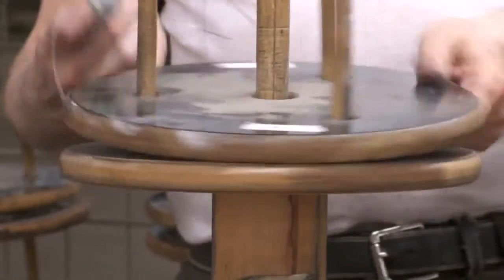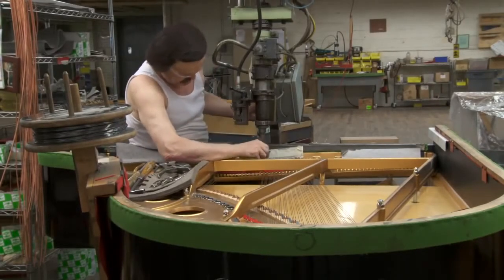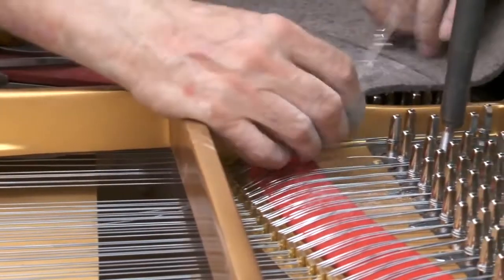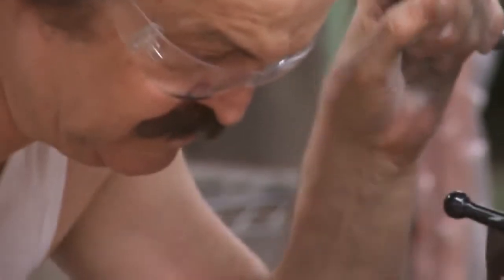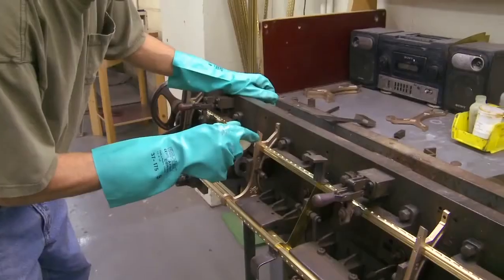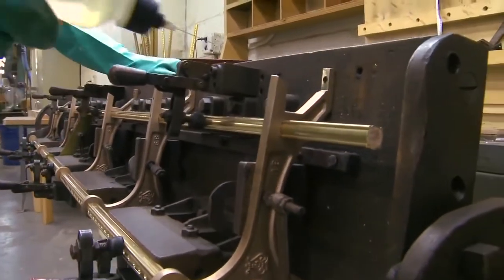The next step in making a piano is adding the strings. The traditional method of stringing by hand is combined with modern technology. The center and upper strings, 3 for each note, are stopped off by the duplex at a precise relative length to the main string speaking length and vibrate in harmony. This duplex scale patent delivers a richness of sound that is characteristically Steinway. The action assembly is mounted on a tubular metallic action frame, another Steinway distinctive patented feature.